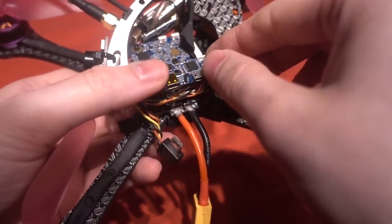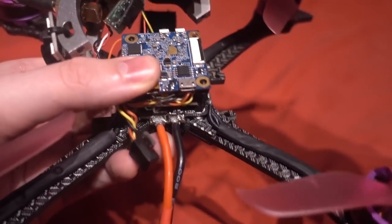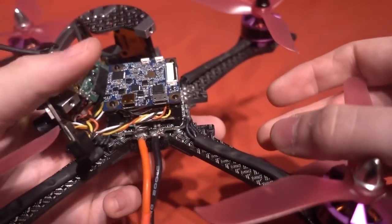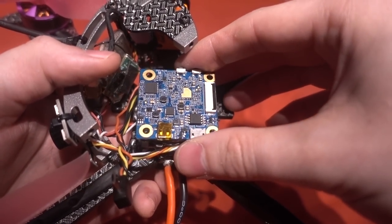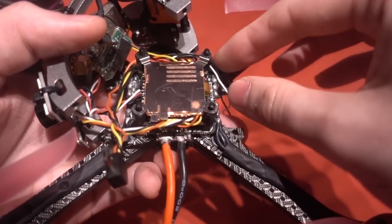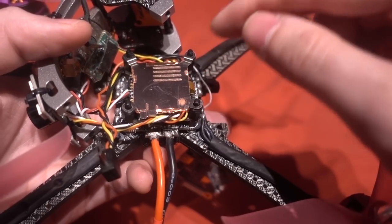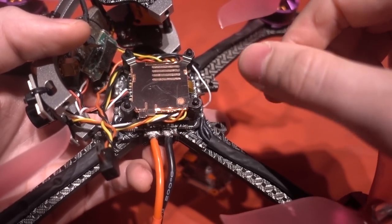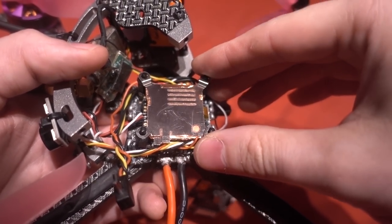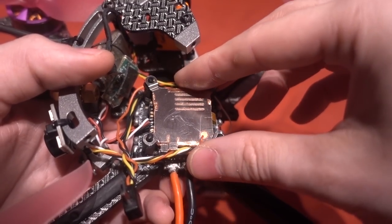And yeah, it might do me some good if I remove the little connector. There we go, got more space now so I can unravel it a bit. Okay, so if I just lift this up, I've actually used the shielding, and that is because, as I was saying, the Kakute gives off quite a lot of RF noise, probably from the built-in regulators. And that's where all the lines were coming from before. And I was still getting a couple of lines off the regulator.